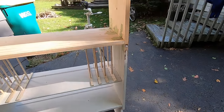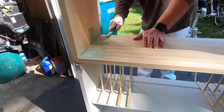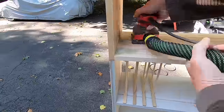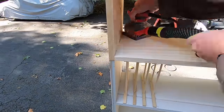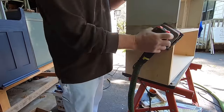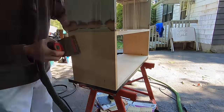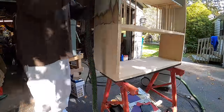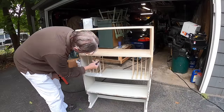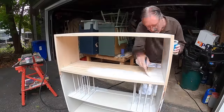So he's filling the holes. I just used Bondo for wood — made it easier, dried quicker, and I didn't have to deal with wood putty. He's really good at being meticulous, so he made sure that it was smooth at the connection site between the original rectangle and the one that he made. I wanted the molding to be able to lay flat, so I didn't want to have any ridges pushing out on part of the molding. So I made sure it was smooth.